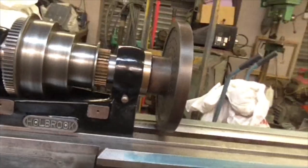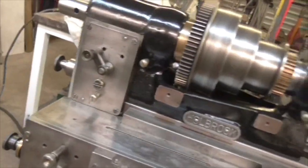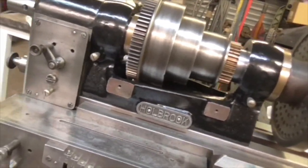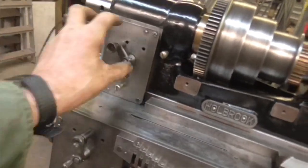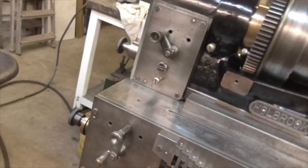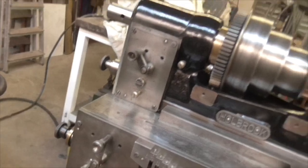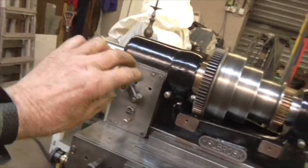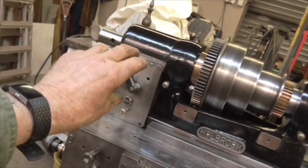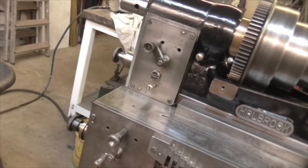That's how free it is now. Felts in, everything oiled up - it's beautiful. I might need to take the gearbox off again and look at what's going on, maybe slightly adjust the position of the selector forks. I was looking at the selector forks and thought: I wonder if this goes on that way up or that way up, because you can rotate it on the spindle and it can be one of two positions. I'm going to look at the alignment and see why it's making that noise.